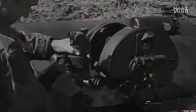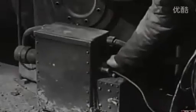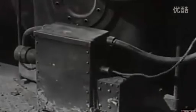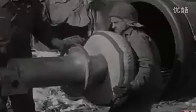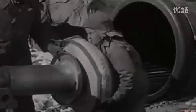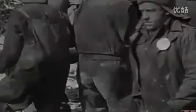The sight is attached and the remote control connection made. A hydraulic pump driven by an electric motor mounted on the elevating segment is used to pump the tube into battery position. The base unit of the propelling charge is inserted using a powder charger equipped with a pair of telescoping tubes.